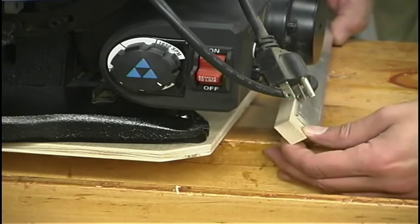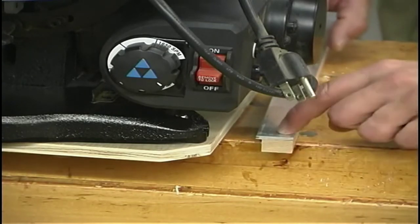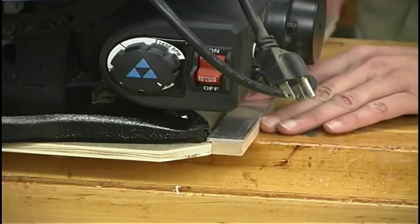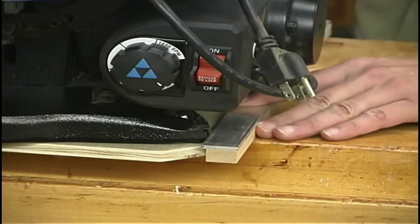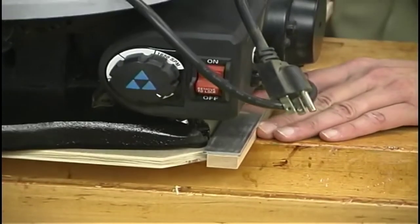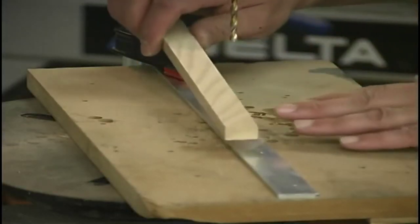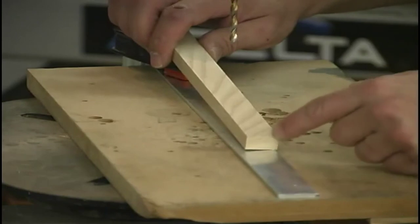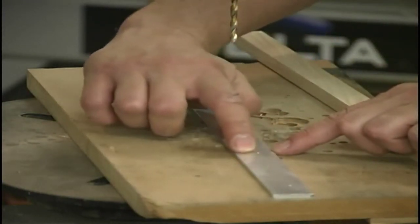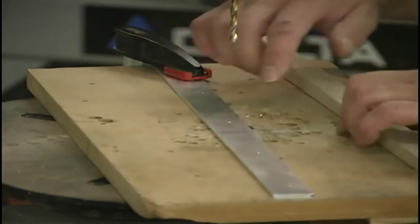And this is hardwood, I just used ash. Now what we'll do is we'll screw these 2 pieces down onto our workbench top. And then that will allow the tool to slide in and out, but it won't be able to tip up either back like so or down forward like so. Now the next thing we'll need to do is lay out our hole locations for our mounting screws. Now I've found the center based on our wooden cleat so that I've got my distance from the edge, and then I've come in 1 inch from each end and then about 4 inches apart across there.